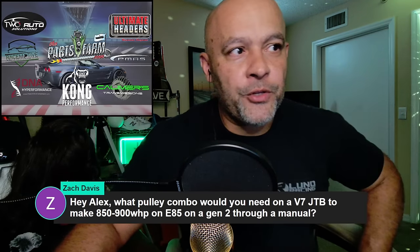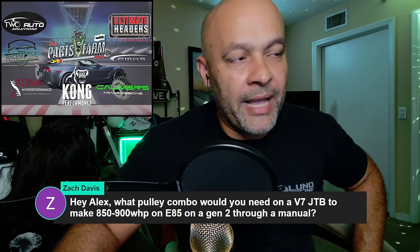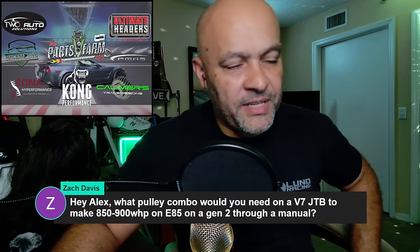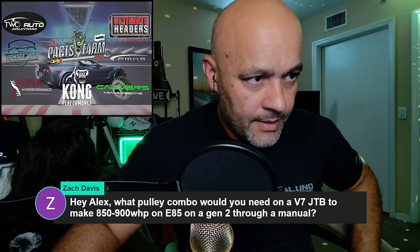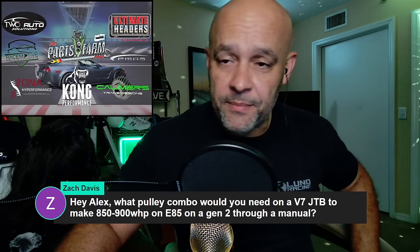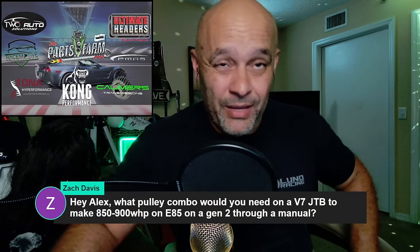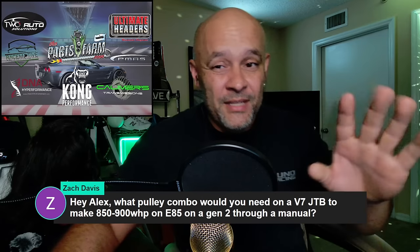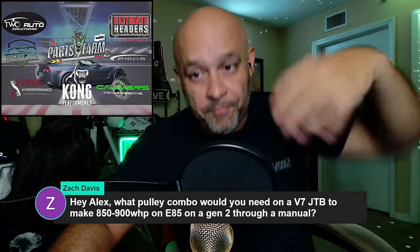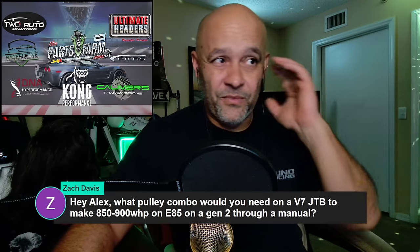Hey, Alex, what pulley combo would you do on a V7 to make 850 wheel? E85 Gen 2 through a manual, V7, JTB. I would say a 3.3 should do it. A 3.3 pulley should do it. 850, okay, a 3.3 because I don't want it to be smaller because of belt slip, and maybe a 10% overdrive. 10% and a 3.3 should really zing that sucker.